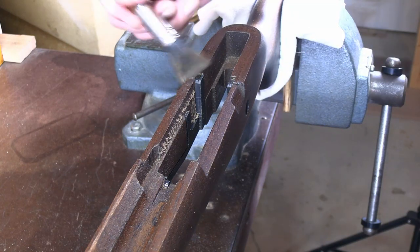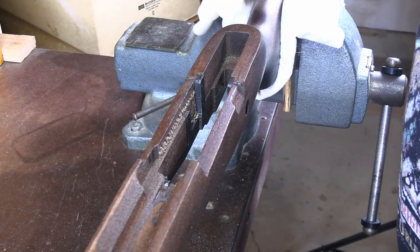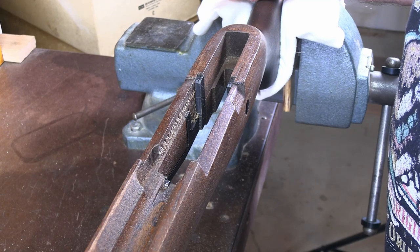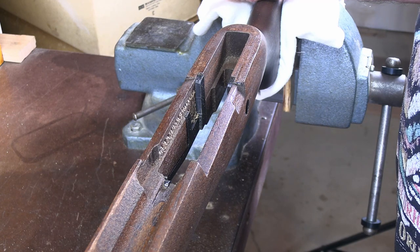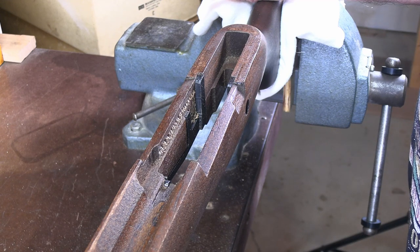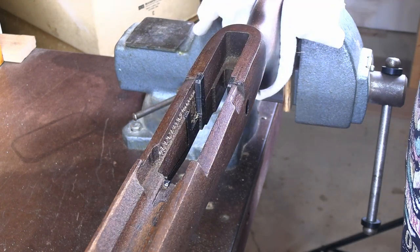I think the greatest problem that people have with glass bedding is they're very overly aggressive. Glass bedding is a discrete process. If you look at the glass bedding that is done on the super accurate FN produced Model 70 Winchesters, you'll see there's probably less than 2 teaspoons of epoxy used in that entire bedding system, and that's only to support where the rear and the front stock screws are. That's all.